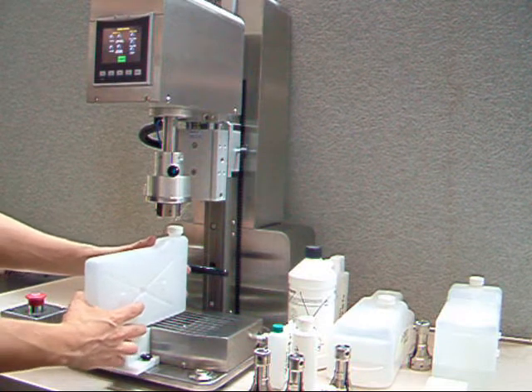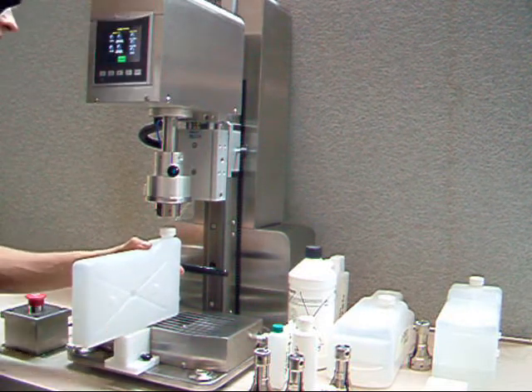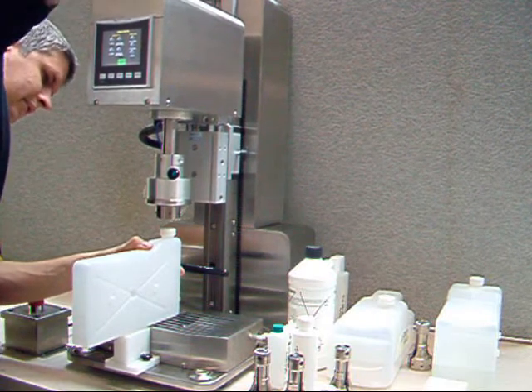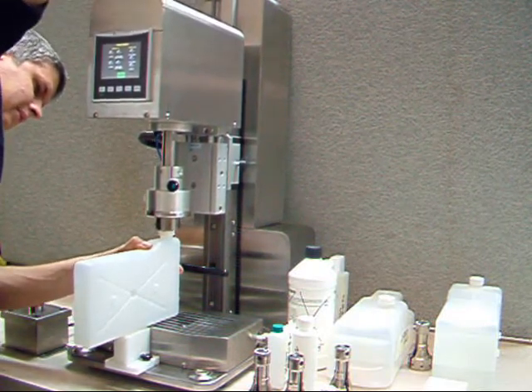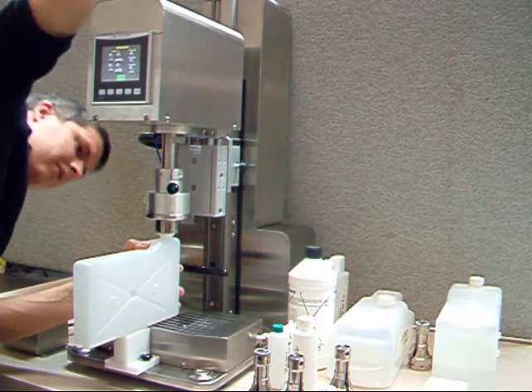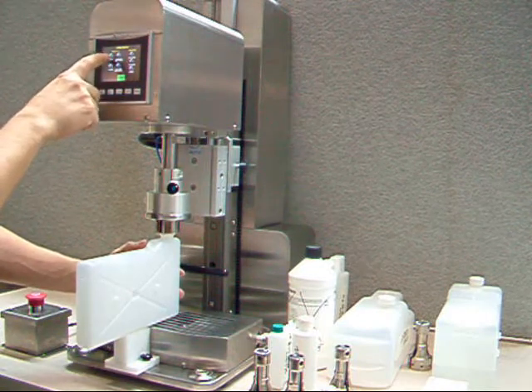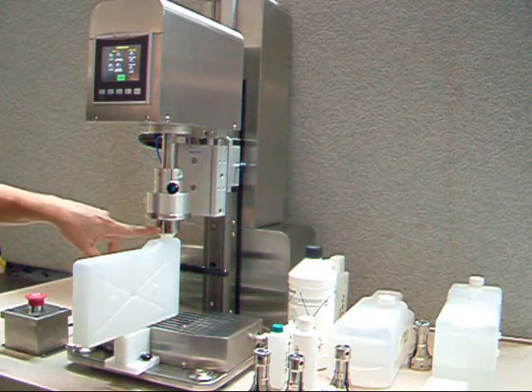When the head is in the down position, I can go in and position my bottle, and at the same time move the crank handle until the collar is engaging approximately two-thirds of the cap, and then turn the chuck on.